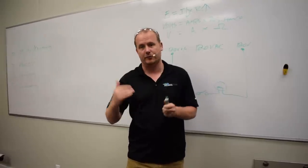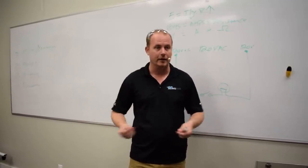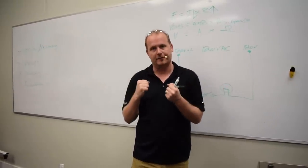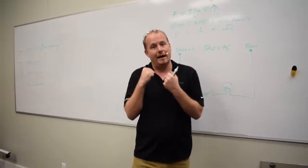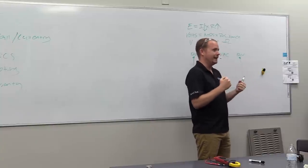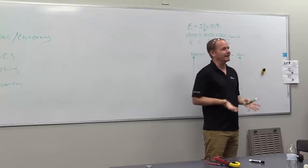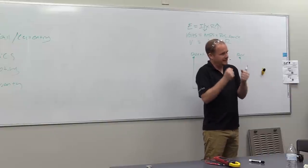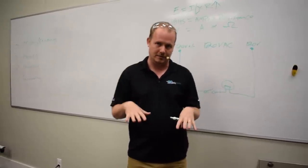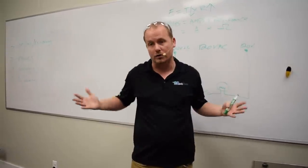And that's why you see this result of a locked compressor, for example. Let me make it real practical. You got a compressor that's locked, it draws really high amperes when it's trying to start. The reason for that is because the physical resistance inside that motor has it locked up, and now that motor, instead of creating this magnetic motion that we want to have in a motor, becomes a big heater. The windings just become heaters, and it goes off on internal overload. We see this really high current. But that's because the physical resistance against that motor results in a decrease in electrical resistance. And with that decrease in electrical resistance, we see higher amperage or more circuit work.